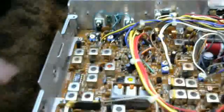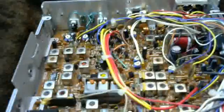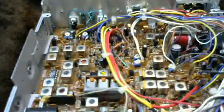this radio hasn't had much done to the transmit yet. I still have to remove the, let's turn the light on here so we have a little more light. Won't blind everybody. The 2SC1969 still in there. This coil here has to be removed for the transmit. Over here, this DC filter choke has to be removed. A transmit receive switching relay is going to be put in there for the antenna circuit.